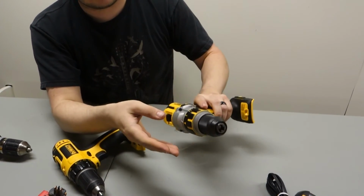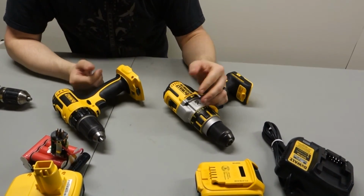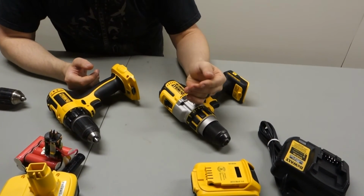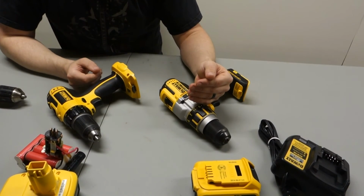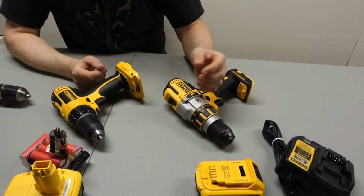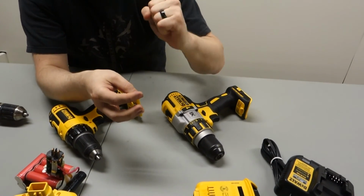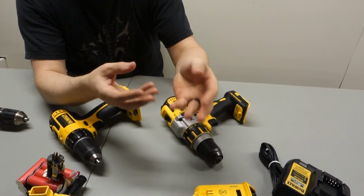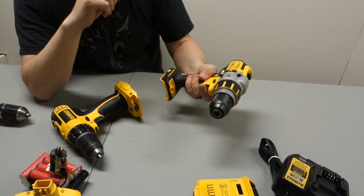And so it's the only way to really drill into concrete, because if you try to drill into concrete with a normal drill bit, it just burns up, and it can't cut bits of sand, because the sand is stronger than the drill bit, so it just burns up your drill bit. You got to have a very heavy metal there that kind of chips away at those little pieces instead of trying to cut them up. It's just trying to break them into little pieces, and you're pulling that powder out. So this is kind of a 201.